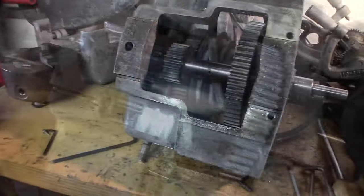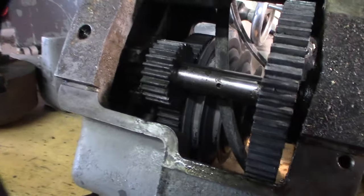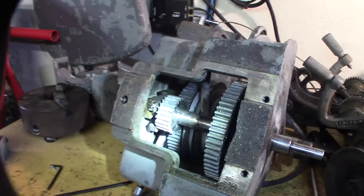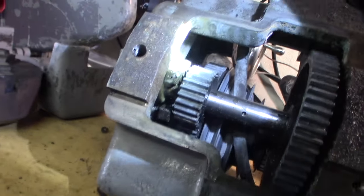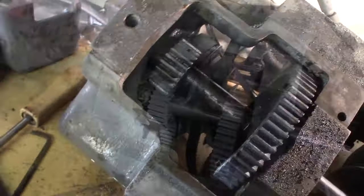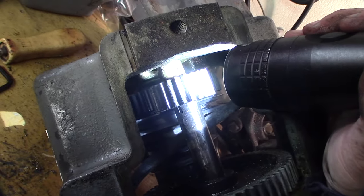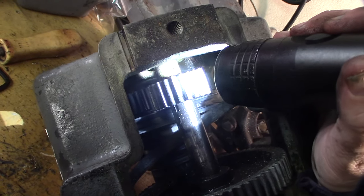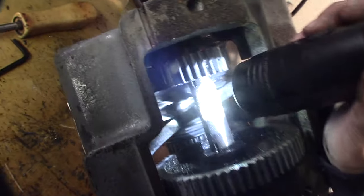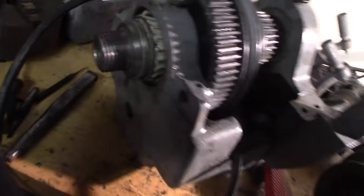I think you have to take the reverse gears out first. I can see it would kind of be interfering with the pulleys - it's like a weird eccentric. It's a headache to get these ones out; there are set screws everywhere. It looks like there's a set pin right there - not a cotter pin - so I have to get a small punch to drive that out.